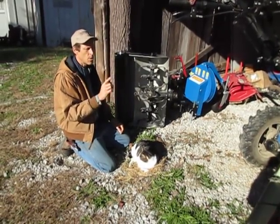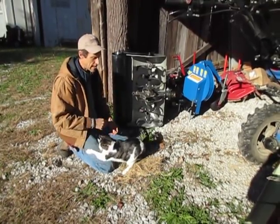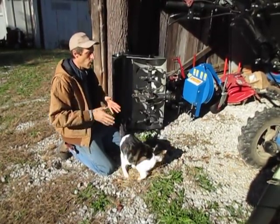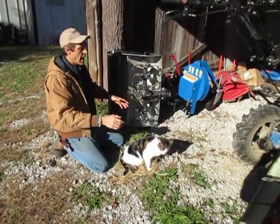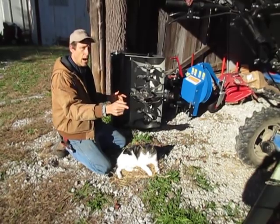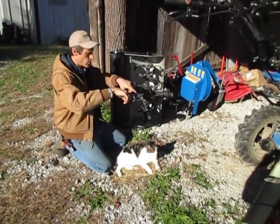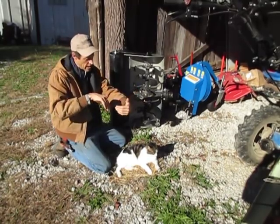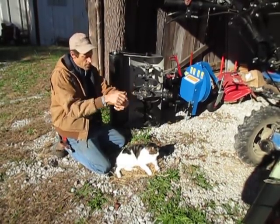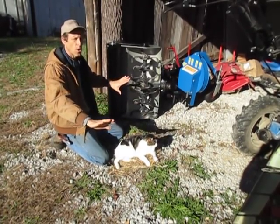Well, if he'd shot that video using a Power Harrow, you'd have seen something amazing. One little line of compost down the middle, and suddenly you make one pass with the Power Harrow and it's fully spread all the way side to side. Why? Because the Power Harrow works the soil side to side — as those tines rotate, the one next to it is rotating the opposite direction; it sort of hands off the material, and it distributes the soil side to side.